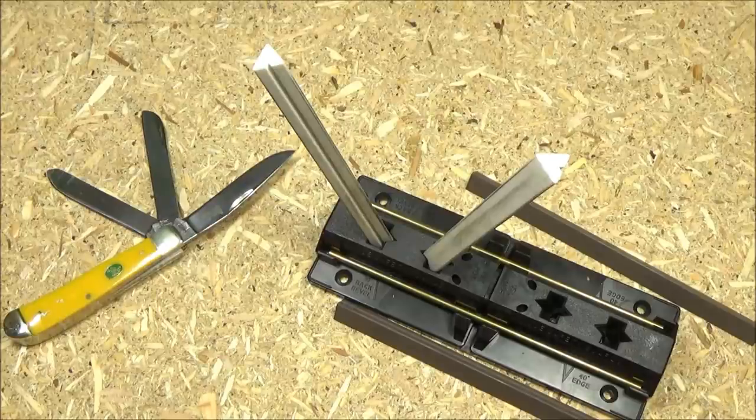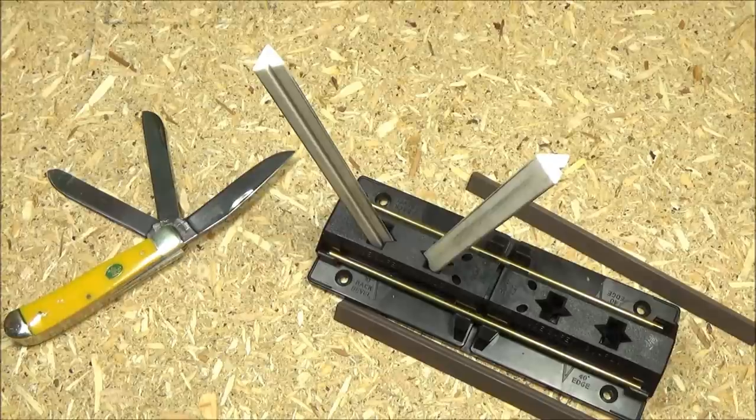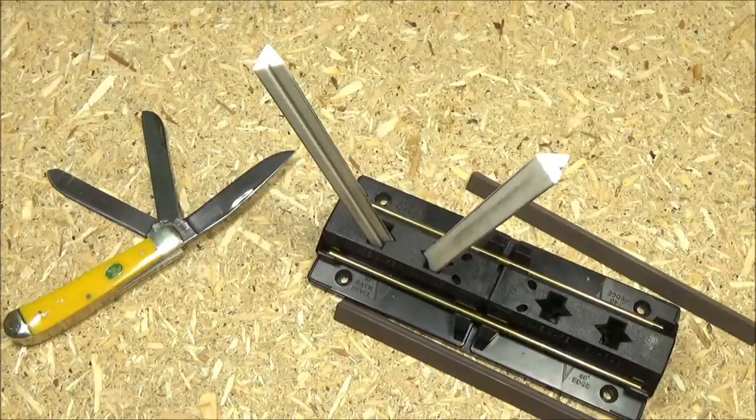I basically did anywhere between 20 to 50 passes on each side of each blade using the Spyderco Sharp Maker. That brought it from medium sharp to fairly sharp, and it only took literally five minutes. If I had wanted to spend an hour on it, you could make these like a scalpel. Another benefit of that 440 stainless is it's just ridiculously easy to get extremely sharp in a short amount of time. It might not retain that sharpness too long, but it's a budget blade — at least you can sharpen it. Thin flat blades like this, as well as the Spyderco Delica and Victorinox Swiss Army knife blades, all work incredibly well with the Sharp Maker. I will include a link to the Sharp Maker — if you like those types of blades, you'll like the Sharp Maker.